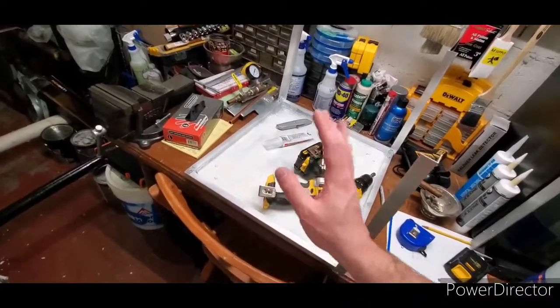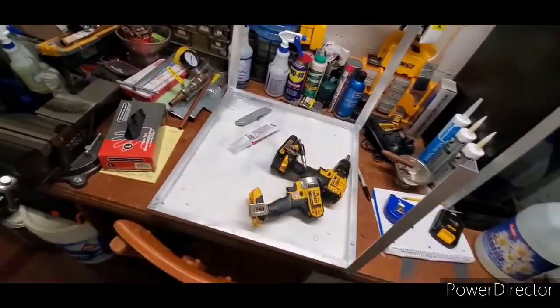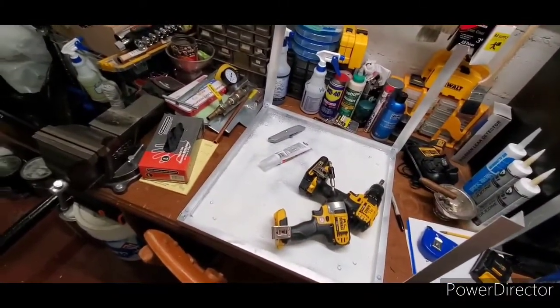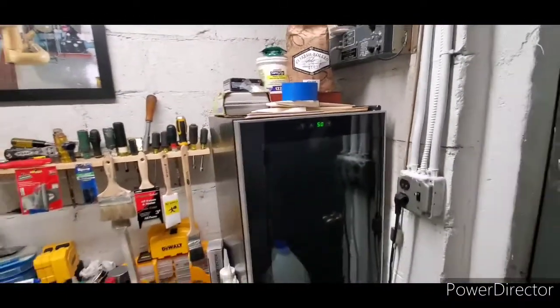I just bought a pre-built water-cooled 404A 9,900 BTU air conditioning unit, which is actually a medium temperature system for a cooler. So, am I crazy? Yes, I am crazy. I am literally going to get this room possibly down to 50 degrees, or at least 55, 56 degrees, with insulation.